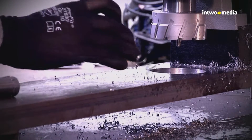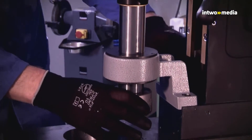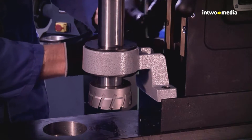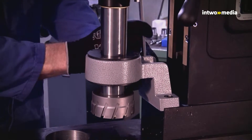After drilling, chips must be removed. For doing so, we recommend using our power worker POW100. But be careful — there is a high risk of injury and you have to wear protective glasses. Also, the drilling core should be treated with caution, as the core becomes very hot due to the cutting process.